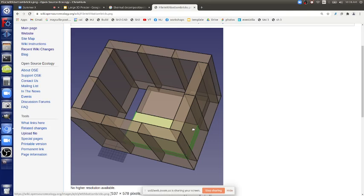In which case, here you can simulate the walls with simply flat panels, which you can do if you make the C-section out of that rebar and stick the insulation in there. But then you still need to address the smoothness of the top, with our tube welded on top or something like that. You still need to weld at least a flat bar on top. So the rebar C, weld a flat bar, yeah, there you go.